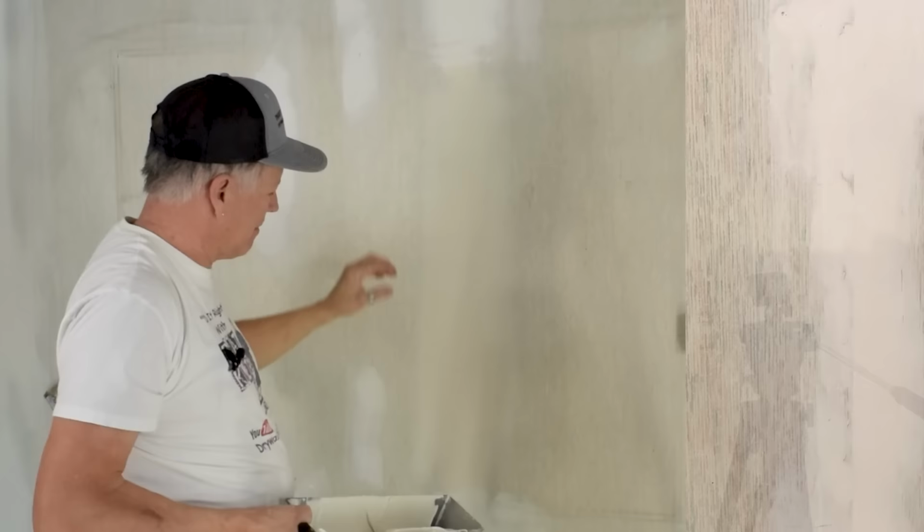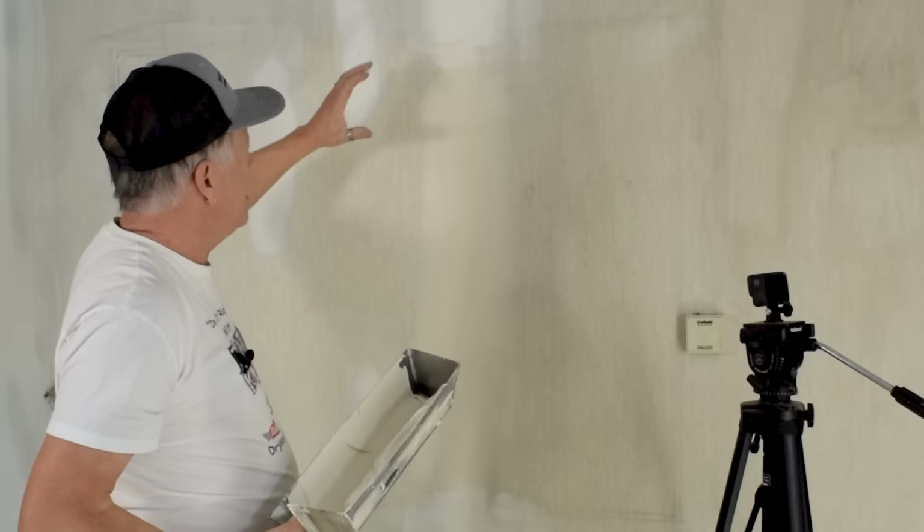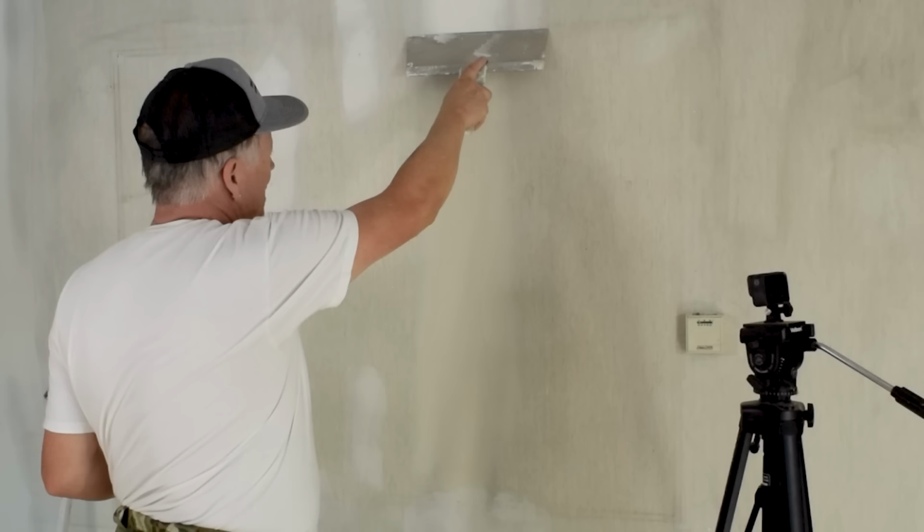And if you happen to have a hump, and you can tell by putting your knife on here, and you're going to leave it smooth and the lighting is going to come at an angle down the wall, you might want to actually float it out like a butt joint. I've got a separate video on that. I'll put that link up here, and I'll try and put that in the description down below. But for this, we just want a fairly thin coat down the middle.